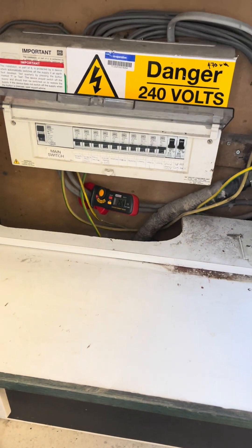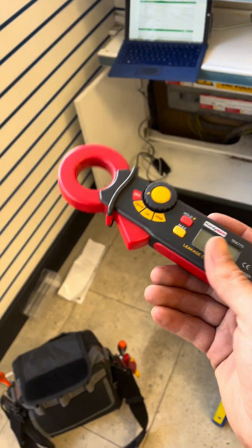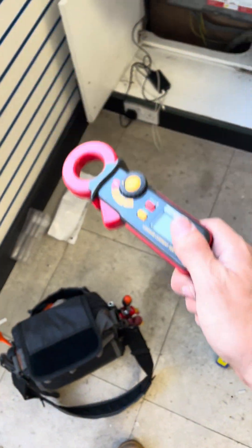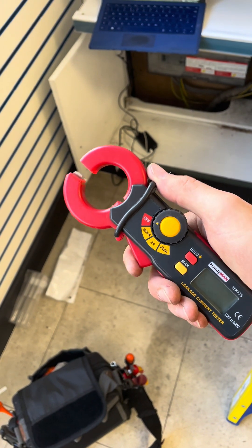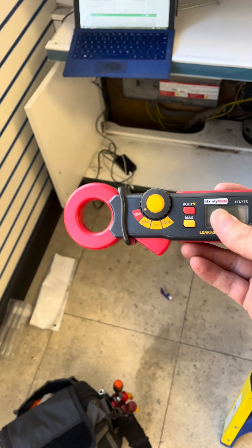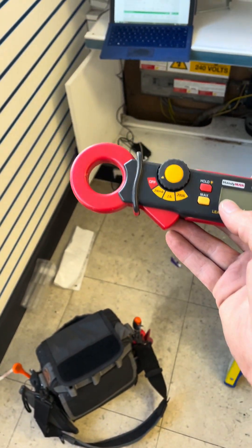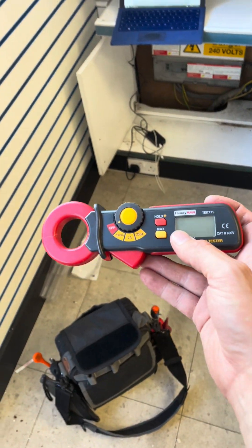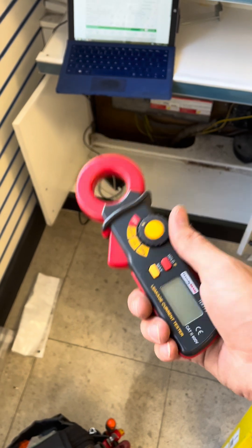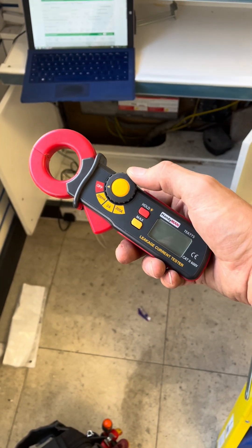A new board is going in anyway - it's going to be an RCBO consumer unit. Now, I'm not saying I use this every single day, and there are cheaper options, but on EICRs, fault finding, or a pre-board check, just put that clamp around the tails and it gives you an idea. Turn off the MCBs one by one - if you've got a high reading it gives you an indication. You still have to do the legwork to find out why there's considerable leakage, but get yourself one of these clamp meters if you haven't already. I've got no links with anyone, it's just a really handy bit of kit. I use it on every EICR even if they've got RCBOs, just to check leakage.